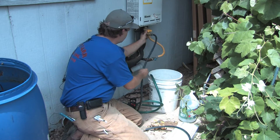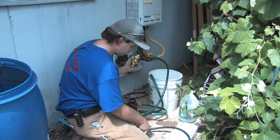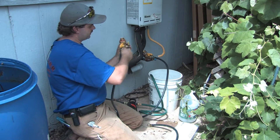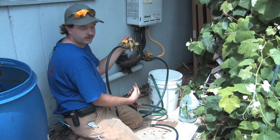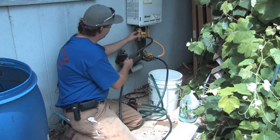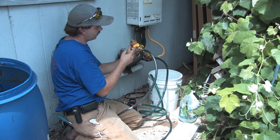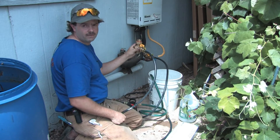This is set up over here — we'll set that on the cold water side. This is on your hot water side coming out. In this valve, you do the same thing: shut it to the off position, which means it's shut the water off, isolated it from the house, and it's coming out right here. With this valve in the on position, it goes off as well. When it's 90 degrees from your pipe direction, those valves are off. When it's in line with the pipe, the valve is on.